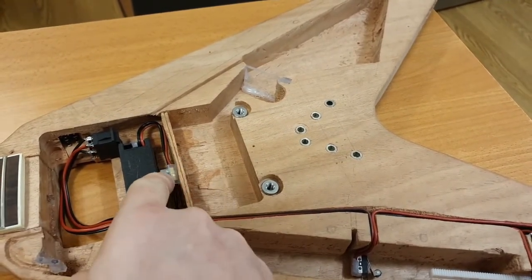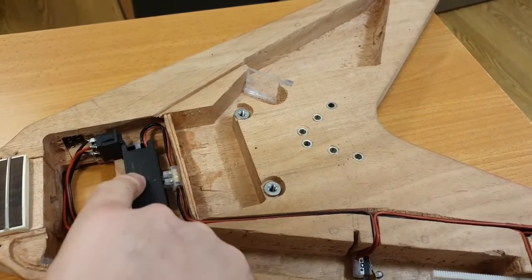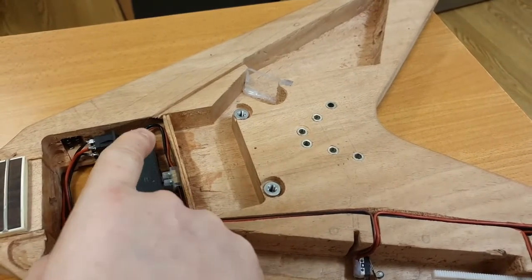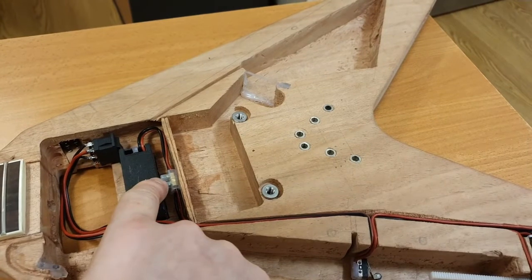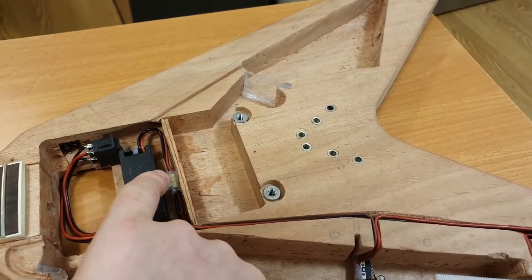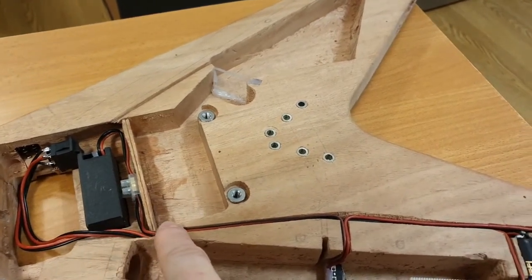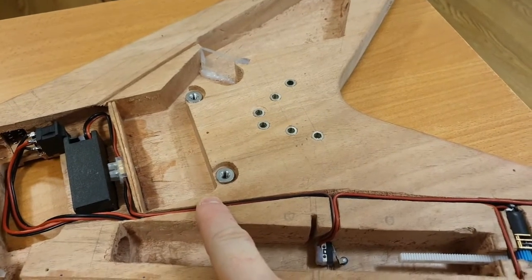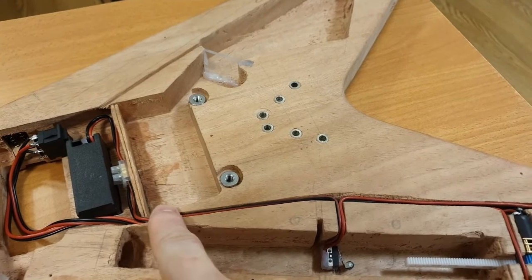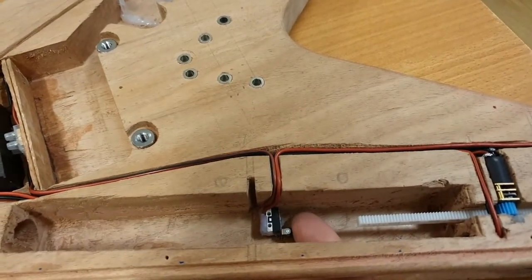So what I did is I put this terminal block there so I can feed everything into the terminal block. Then that terminal block can go back in here and feed all of the individual components. So it goes from the battery into the terminal block. Then this is where it gets maybe a little bit more complicated. This terminal block runs down this trench. Now this trench is actually quite deep because it's got 6 wires stacked on top of each other. This runs all the way down to this little micro switch here.